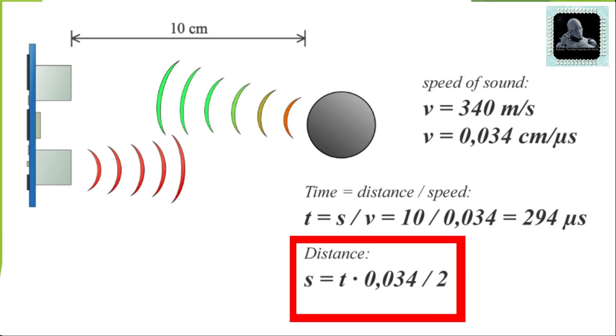The fourth block is the sonar sensor, mainly responsible for measuring the distance. The sonar sensor emits an ultrasound at 40 kHz, which travels through the air. If there is an object or obstacle in its path, it will bounce back to the module. Considering the travel time and the speed of sound, you can calculate the distance.